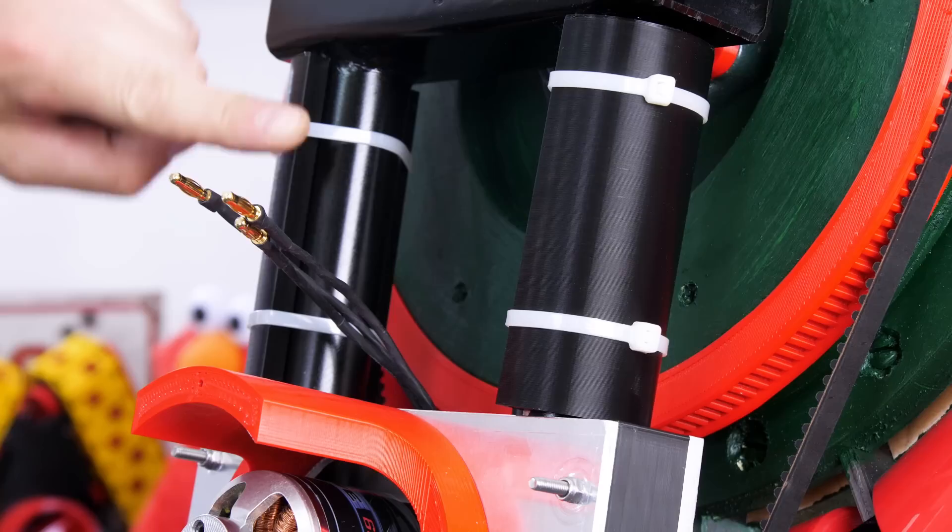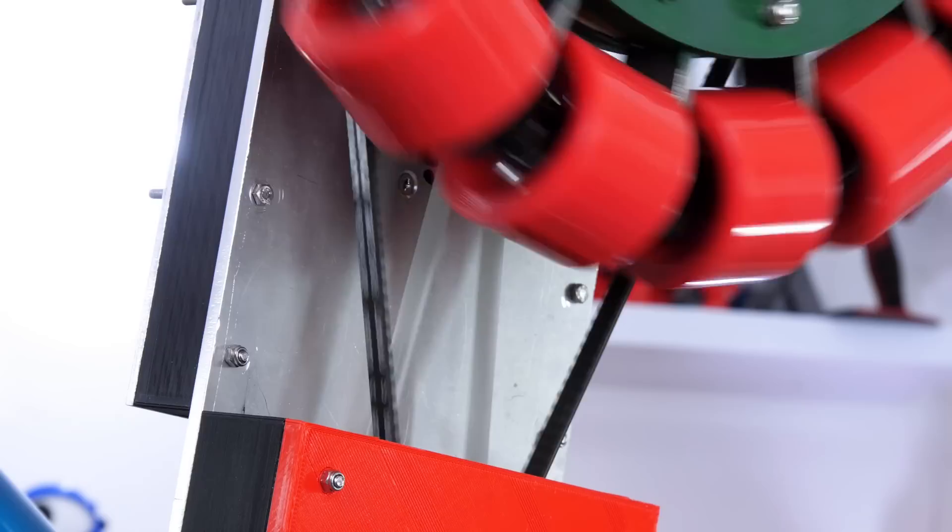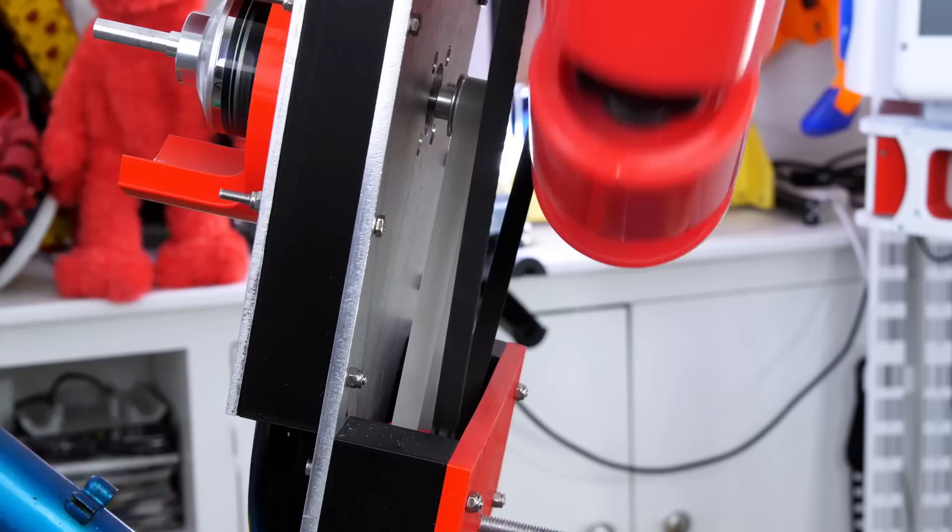I'm using the forks as sliders so I've put these spacers in which are two more 3D prints zip tied on, and that allows me to tension the belt up to just the right tension. The T5 doesn't have any method of tensioning so it's just the right length, and the HTD is tensioned up with those spacers pushing the assembly down the forks. That seems to run okay and all the belts are aligned so I can run it round and round and they don't walk off the pulleys.